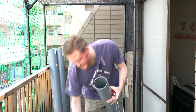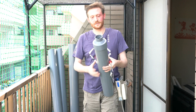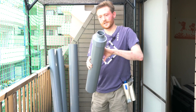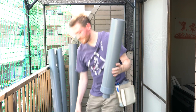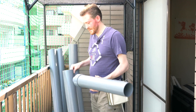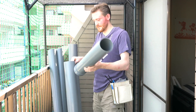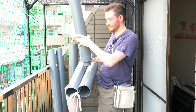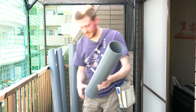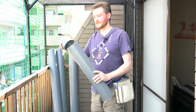Why is that? Because at the end of these I'm going to add a smaller fitting. This is going to go in both ends, and essentially the drain tube at the bottom is going to have 50mm holes. This goes from 100 to 50mm so that it fits into it — it's going to basically sit on top of the 100mm pipe, of course vertical like this. So the uneven edges, the uneven cuts, it's not going to matter that much. It's going to be a fitting like this in both ends.